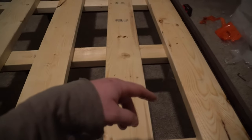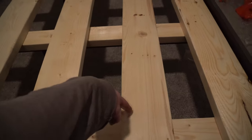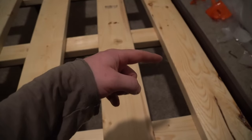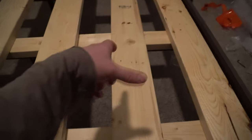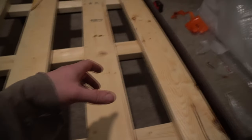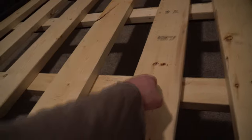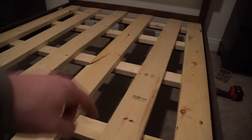Do your two edge pieces first. After that you'll have 49 and a half inches remaining for me. Each board is five and a half inches wide, so five and a half times four boards equals 22 inches. Take 49 and a half minus 22 — count the spaces: one, two, three, four, five. Divide that remaining number by five and you get the spacing between each slat, which just happens to be five and a half inches.